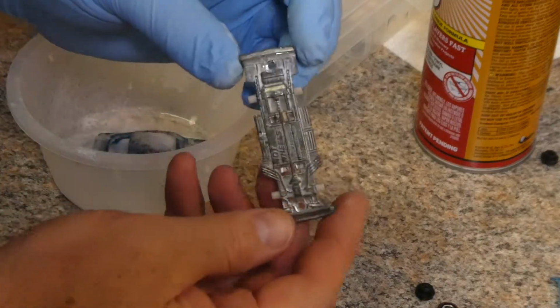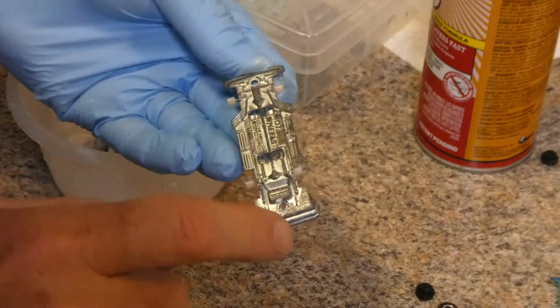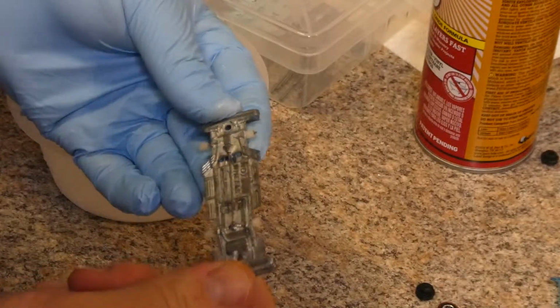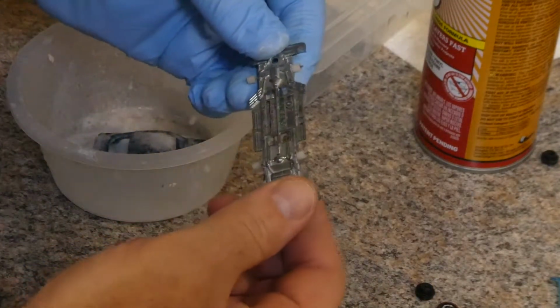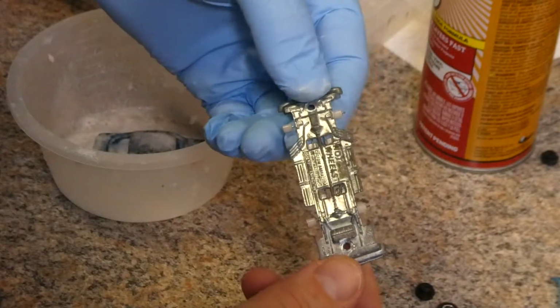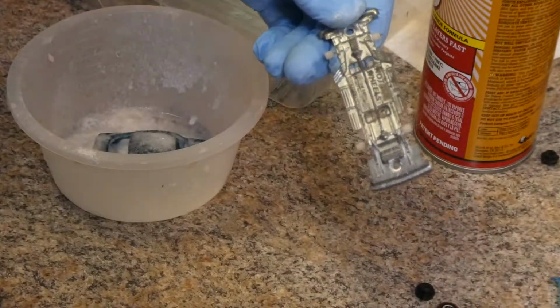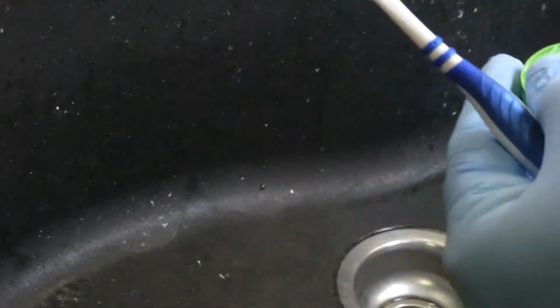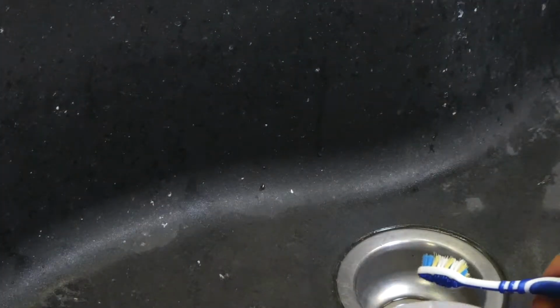Alright, now I want to go get some of this oxidation off here. So what I'm going to do is I'm going to go dip this in Lime Out or Lime Away, yeah, Lime Out it's called, for about 5 seconds, and that'll eat into that oxidation and I can brush it off and then clean it. Let me just take you over there and show you. Here's my, what did I call it? Yeah, Lime Out. Pretty strong stuff, so don't leave your base in there for more than a handful of seconds. And you'll see it just immediately start foaming up.